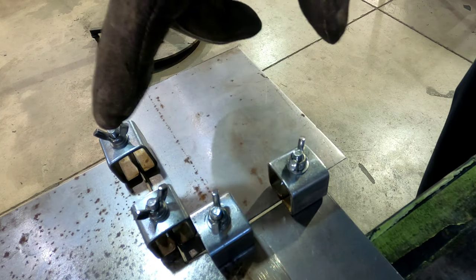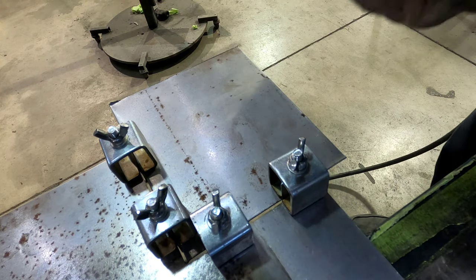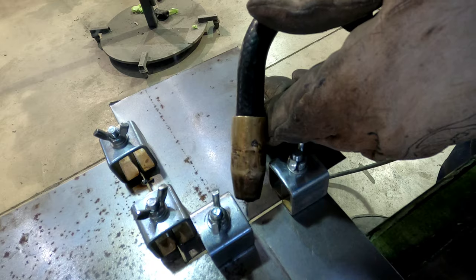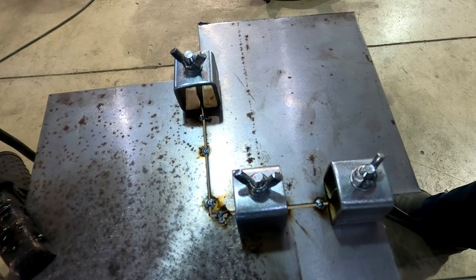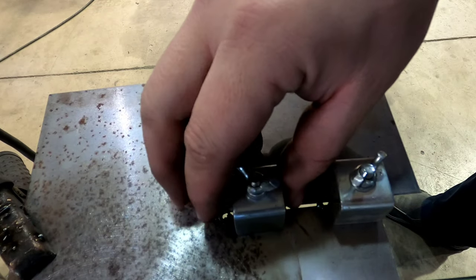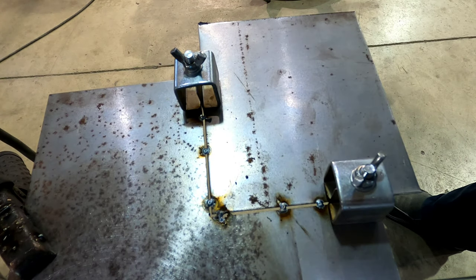What I need to do now is go between my clamps and spot weld close to the clamp so it holds everything where I need it. Now that everything's been tacked up, what we do is just pull our clamps out — loosen them up, reach back, pull that pin, pull the clamp out. Sometimes they can be a little bit of a bear to get out. Then after you pull all your clamps you can just weld up your seams.